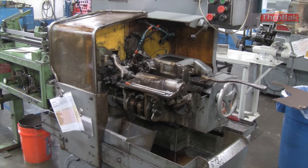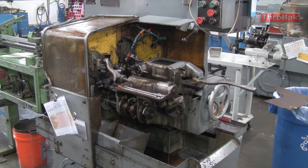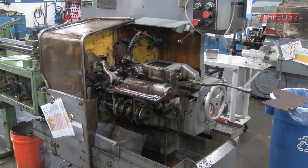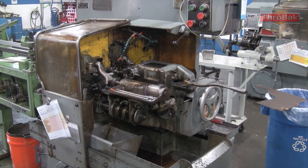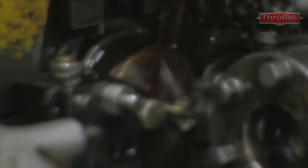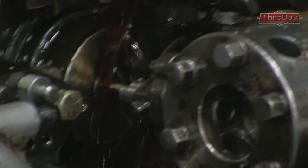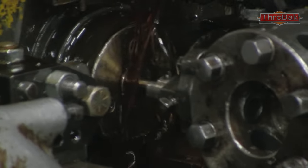Alright, these are the throwback maximum vintage PAF slugs. I found out these really need to be done on an old-fashioned screw machine to get the right look — CNC gives too clean of a cut. What we're going to see here is an old-school Brown and Sharpe screw machine. To get the right look, they need to be made on one of these. It takes more time to make the slugs than the screws, because screws are made on what's called a cold header machine. When I say 'the right look,' I mean that little bullseye tip — you can see it cutting it off right there.